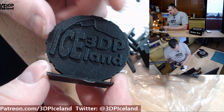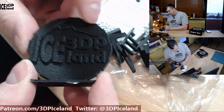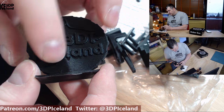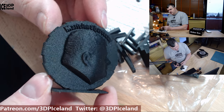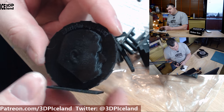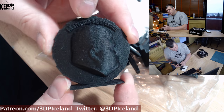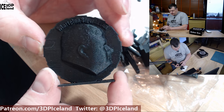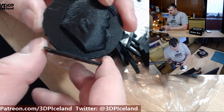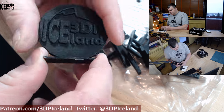I then printed out my maker coin and that came out excellent. The surface finish has more of a texture — you don't really see the layer lines in the print, so it has a nice texture on the side. The letters came out great with no issues printing this model. You can get fine details working quite well with this filament, and it has very good strength with the glass fibers fused into the filament.